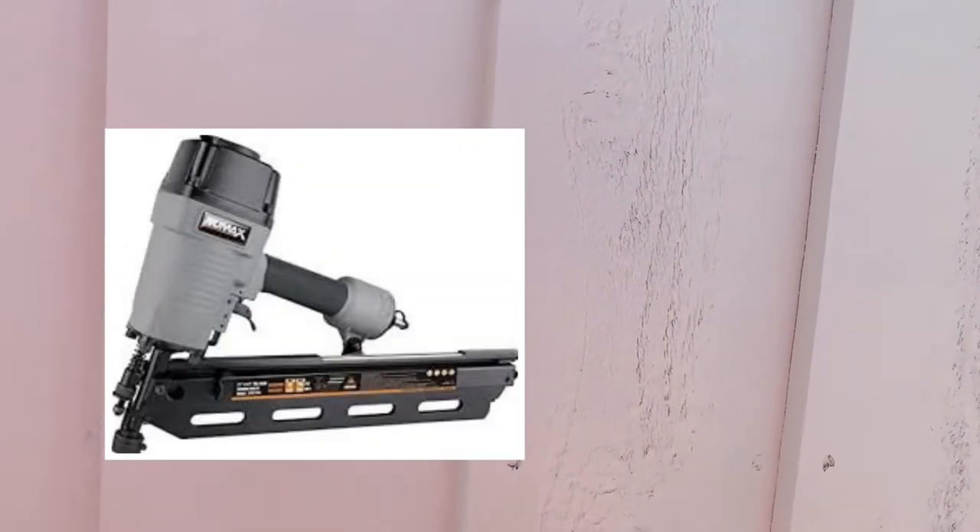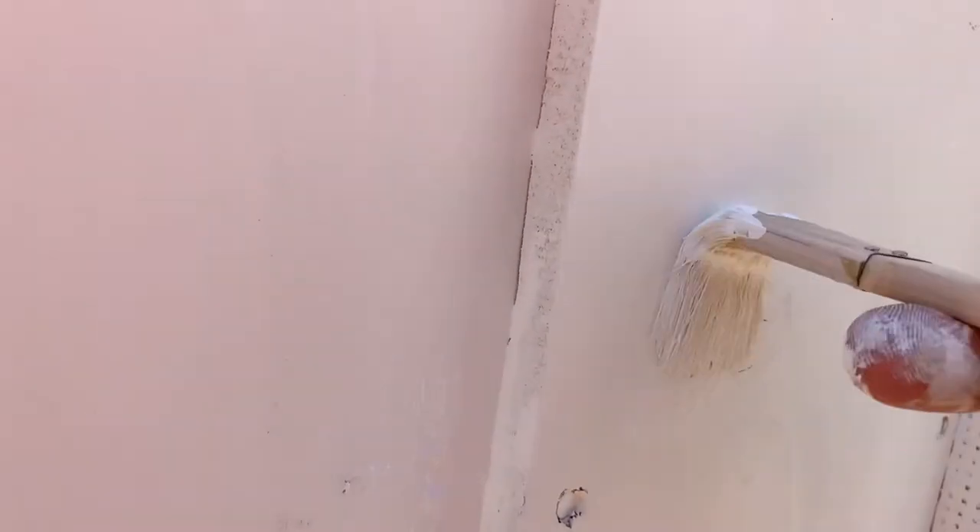I want to show you what I'm doing. I'm actually painting each hole where my nail went in when I was putting this up with the nail gun, because each nail got countersunk a little bit. The problem with that is it casts a shadow and you can see a little black ring or black spot wherever there's a nail. So I'm doing each one by hand, and the thick paint is actually making them look a lot better — you can barely see them because they're not casting any shadow.